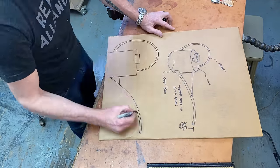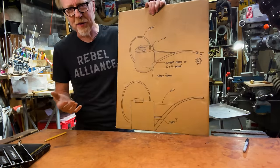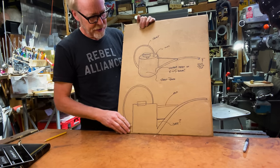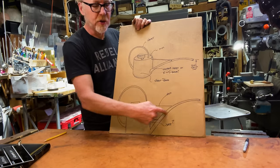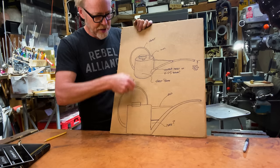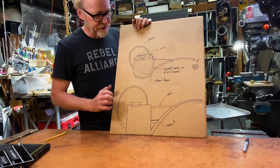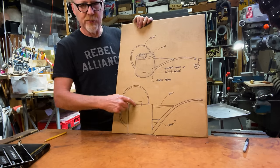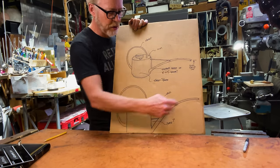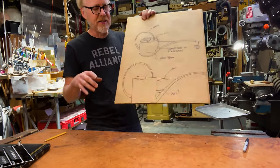All right, I have basically figured out the rough structure here. I've been looking at a lot of watering cans, and this is a very basic design. Got a long spout with a curve that is above the top water level of the can, so water won't leak out. A nice handle for being able to pour, and I may make that handle thicker at some point along its journey so that it's comfortable. A fill spout, which does not need to be covered. Some support here for supporting the long spout. And I may actually make this spout out of many pieces of stepped engineering brass.